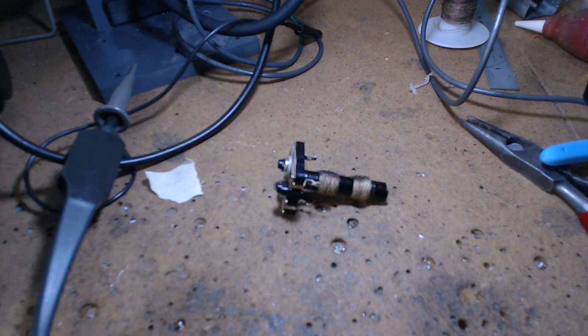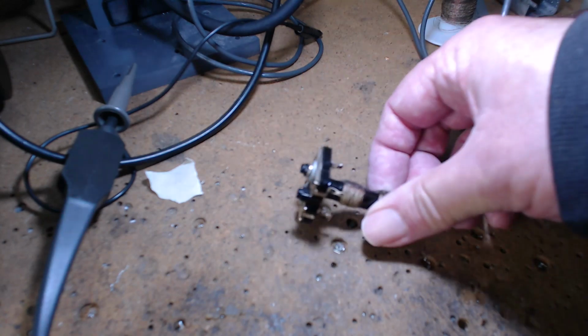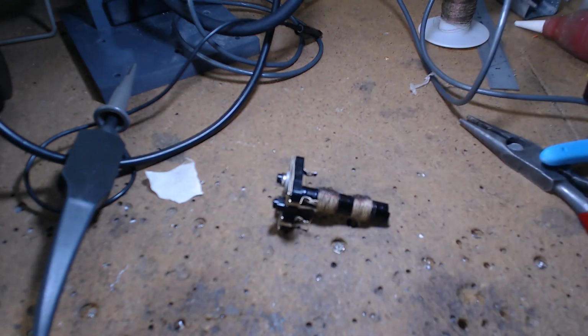But this has two tunable capacitors, and this coil itself goes down to 902 kilohertz and above 1,000-something kilohertz. Okay, that's the way I designed it. I sat in Professor Coil, and I changed the amount of turns. And I'm thinking, I want to be in this zone.